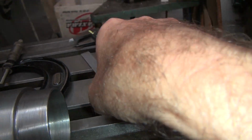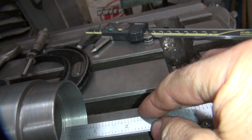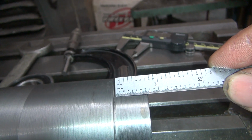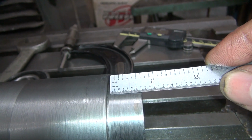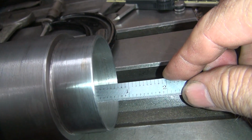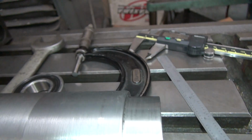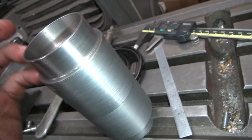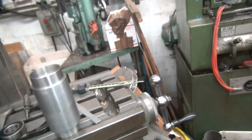And it looks like the inside is not quite as deep as the OD. Yeah, we're 700 there and we're 800 there, so we get to pull back a little bit. So yeah, we'll mark it, see how much to go. But there should be enough material to be done when I'm safely done. We need 600 when we're done. So I might just use the hacksaw. I don't know. It's not that big of a cut with a hacksaw.